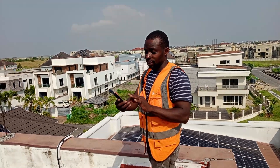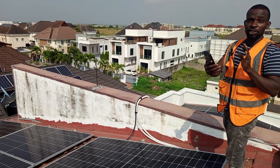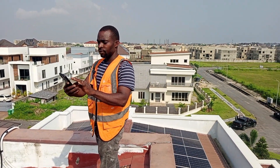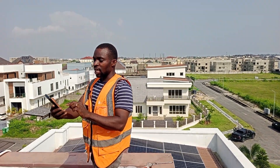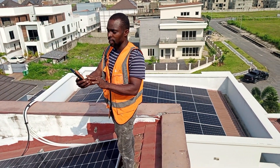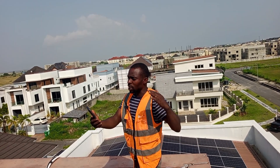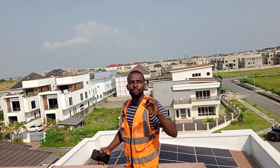Each panel that we have — for my followers — we have 625 Watt, 70 pieces. That is 43,750 Watt. Then you divide by 1,000. So what we are generating at peak sun, we are generating 43,750 Watts — that is 43.75 kilowatts.